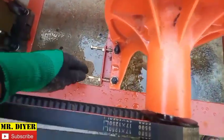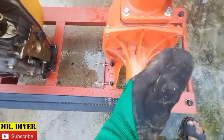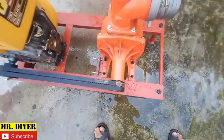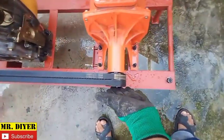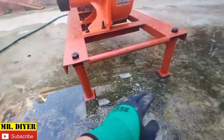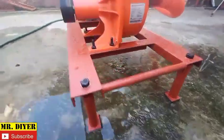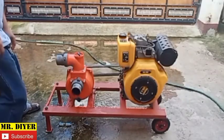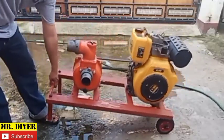I also have a tensioner so I can adjust the tension of the belt. I've got two tensioners so I can adjust alignment in either direction, because the more the pulleys are aligned with each other, the less vibration you'll have. I can undo this nut to adjust the engine position when on uneven ground. I also have wheels on it because this is quite heavy — with this setup it will only require at least one person to move it.